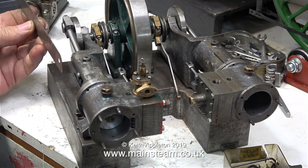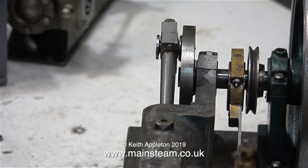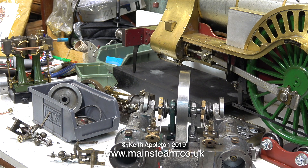There are so many things wrong with this engine, too numerous to mention — for instance, look at the angle of the connecting rod to the crank pin. I said to the owner the best thing you can do is put it back on eBay as it is and describe it as spares or repair. It is rebuildable and repairable, but it would be impractical for me to do it. On the positive side, the Double 10V he bought via eBay wasn't too bad, though the crankshaft is weak — it's held together with roll pins. A cautionary word for beginners: be very careful when you buy things online when all you've seen is a photograph. Rebuilding this engine successfully is far in advance of the capabilities of a beginner.